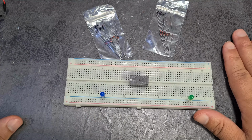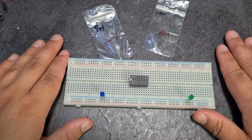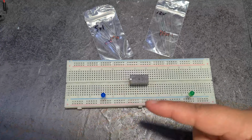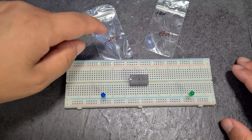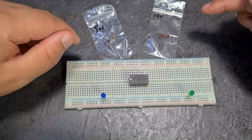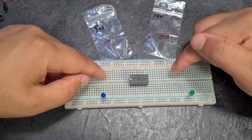Then when it drops below 12 volts, the solar panel gets reconnected again, and then therefore it starts charging the battery again. So that's the plan. That's a simple one-stage charger. The next stage will be to use 2 set levels, and we'll do that in the upcoming video. First, let's see if I can get the Zener diode. So I've got a 5.1 volt Zener diode and a 12 volt Zener diode. Let's see if I can use these to control the voltage at which point the relay triggers.